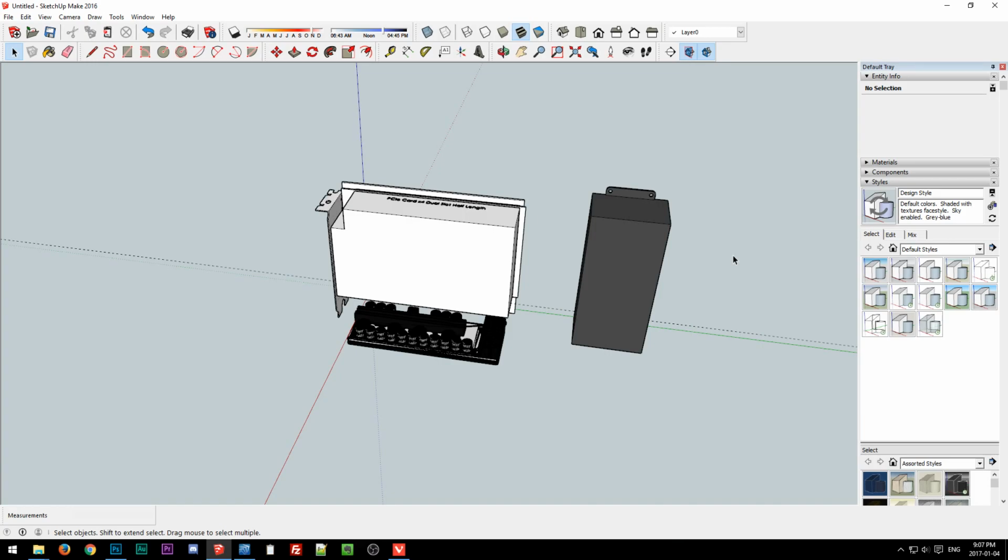The thing is I don't know if the HD Plex will be susceptible to that. It's only 300 watts, which is really beefy for an internal AC/DC unit, but it's still not a ton. So I don't think it has enough overhead to handle the Nano. I don't have a Nano, and I don't know anybody who has one, so we won't really know until somebody tries. I think Larry at HD Plex has tested it with the 970, and he knows for sure that's perfectly stable for several hours. But the Nano, we're not sure.